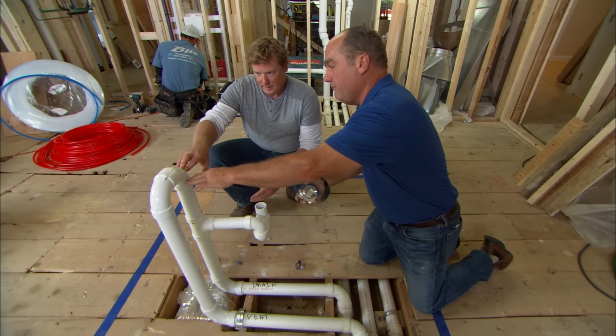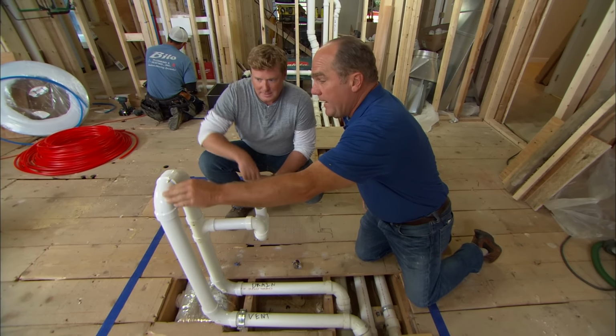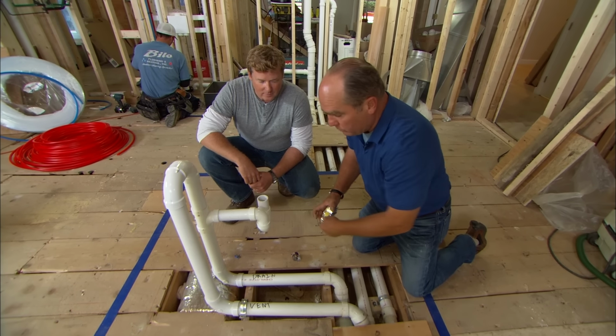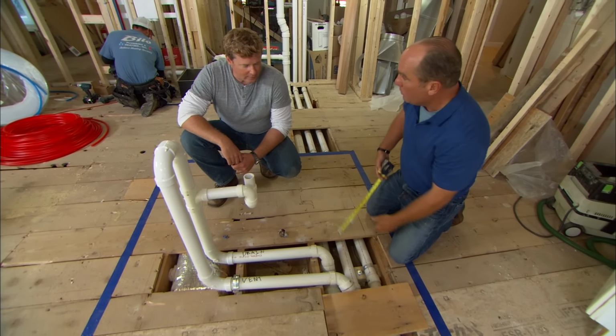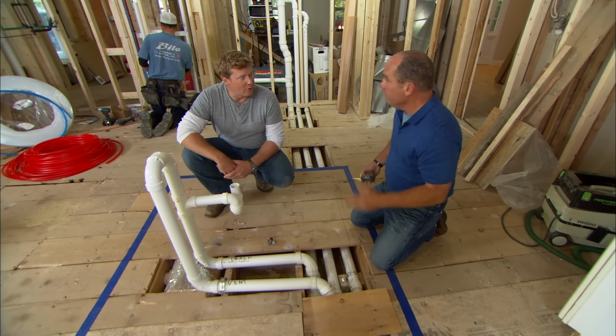What's it going to do? It's not going to flood over the sink. It's going to turn this way, because this is lower than the sink top. That's right. So now this pipe, which should be filled with air only, will have what? It would be filled with water. And if that now gets filled with water, this is a trap, and now you wouldn't have an operational vent. So we don't have a good vent.